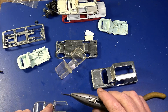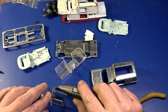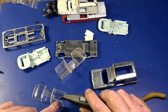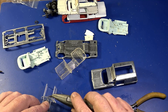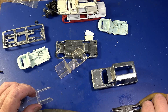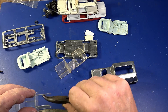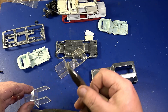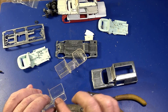I made a few more lines and cuts and gradually picked them out piece by piece, very carefully. They usually snap when you've got the crack in it - it's like cutting tiles, it'll snap. So I managed to get it all out and cleaned it up - it's all nice and smooth and ready to take a new piece of glass. So what I'm going to do now, I'll just demonstrate that. All you do is you get your blade and you just score it where you want to cut it. Give it a nice score. I went on the wrong bit trying to do it on camera - I can't see what I'm really doing here.